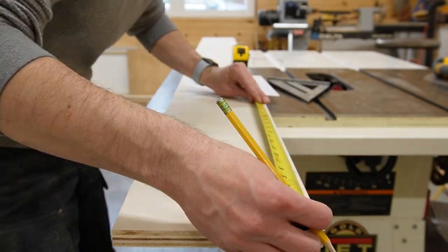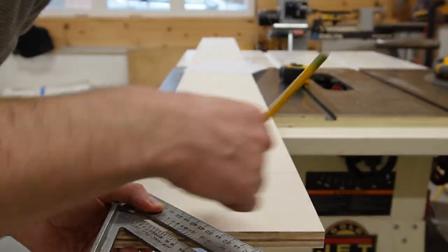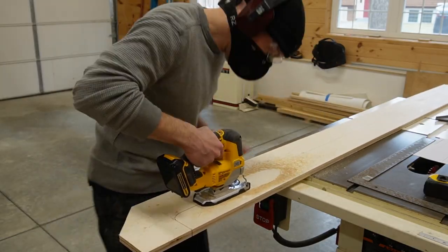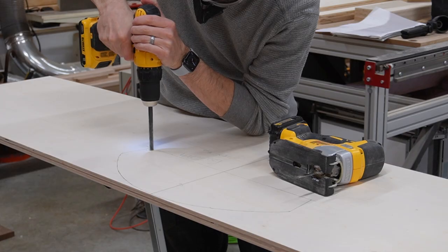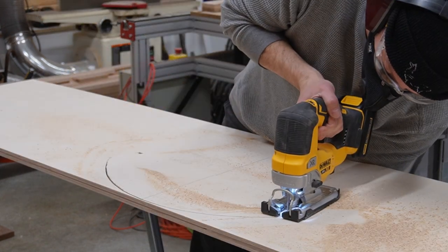That made quick work of the seven legs, so I started to lay out the front of the torsion box — the piece that has recesses for the miter saw and the drill press. I cut all of the details using a jigsaw; you can achieve great results with a sharp blade and a steady hand. I used the same approach to cut the slot-shaped opening for the drill press and the opening for the dust collection, drilling a pilot hole first and then following the lines.